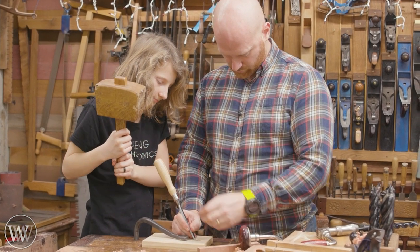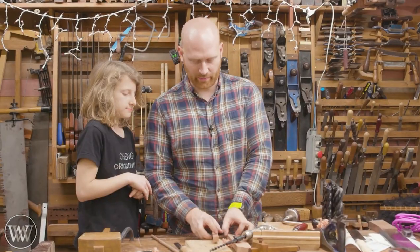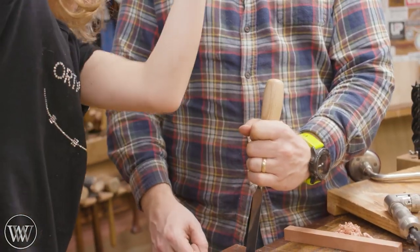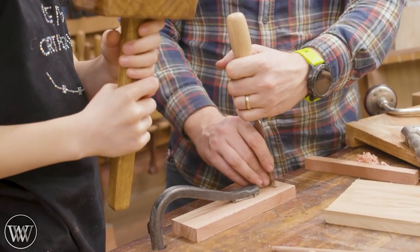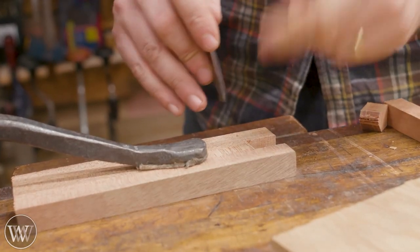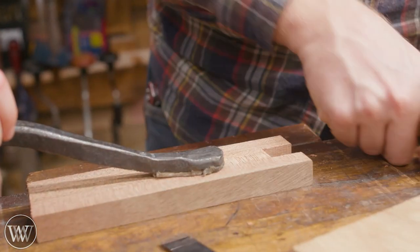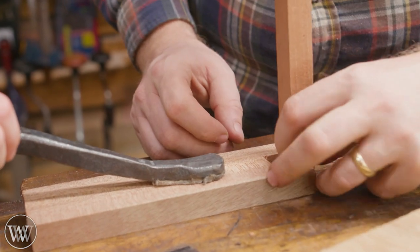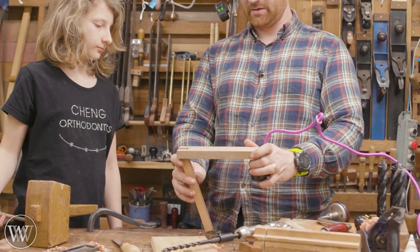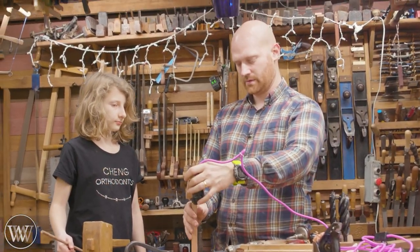While we have the chisel and mallet out, we're also going to move over to the arm that goes on top. Because we cut down on either side, now we're going to chisel out the waste in between — just like taking out a dovetail. We chop in, then come in from an angle, chop in again, until we're down about halfway. Then we flip it over and do the other side until that block pops out. Now we have our chunk out of there. We want to make sure the arm fits in — in this case it didn't quite, so we had to remove a little more because one side was cut at an angle. I could show her how to pare that out.